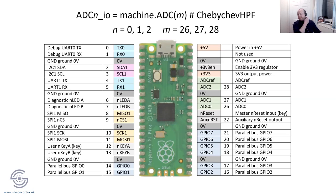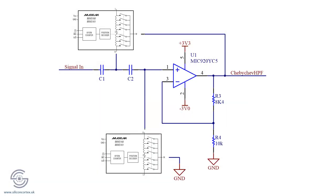I appreciate that. I have a suggestion, and please correct me if you think I'm wrong, Stephen, because I might be wrong. If you were to use those pots in the way that you're suggesting in that diagram, it might be a good idea to make sure that you've got resistors between the C1, C2 point and the output. Otherwise, you're going to get a perfect feedback.